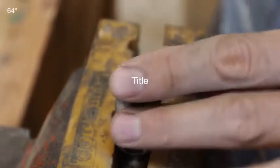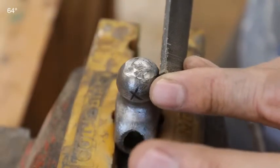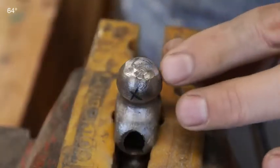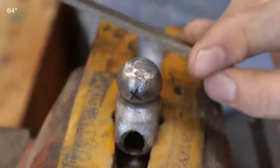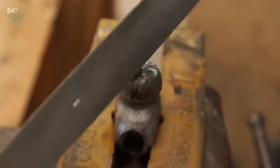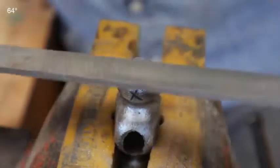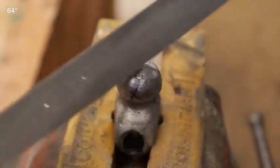The process to resurface the round portion of your ball-peen is to always keep your file moving. You don't want to go flat across because you'll file flat spots. So as we're filing, we're moving up and rolling at the same time — it's a motion like this, and you're working your body around, basically connecting a line around there like a path around the dome, taking out those cuts and imperfections. Now if you have things that are super deep, you'll have to make a decision to continue or just leave them, or to continue taking the head down. This one here is not too bad, so I'm moving my body as needed, keeping everything symmetrical.